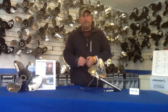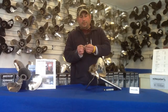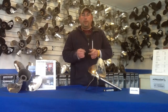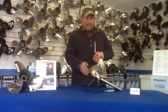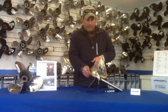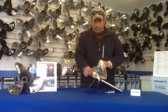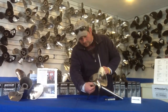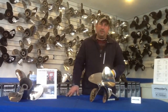The last step of the process is the cotter pin. There are different types and sizes and lengths of cotter pins, but typically if you go to your prop shop or marine store, the cotter pins are sized just for the shaft. In this case I have a cotter pin that I already bent before, but you take a stainless steel cotter pin — because if not, it'll just rust and come out — slide it inside, and then bend it over with a pair of pliers. Basically, that's what it looks like when it's all done.